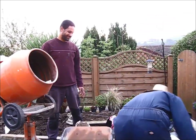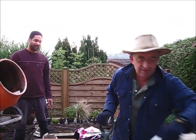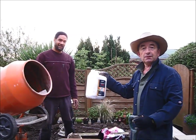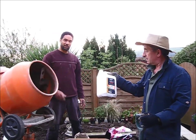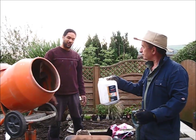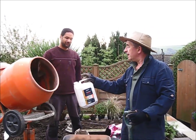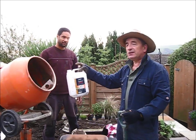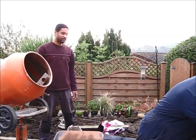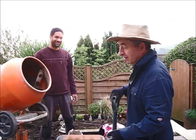Okay so I've put one cement in so far, and another one there. The other thing Alvar likes to add is this stuff here — it's called a plasticizer. A plasticizer, ladies and gentlemen! It makes the mix a lot more workable and easier to use, and often you can work with it for a bit longer as well. We put some water in first, then the sand and cement, and just splash a little of the plasticizer in — a couple of capfuls basically.